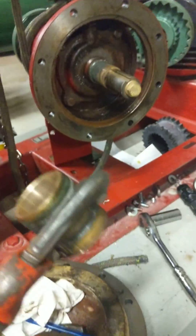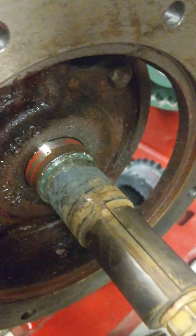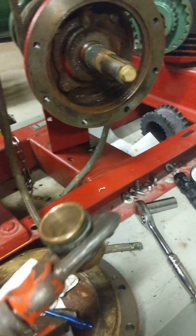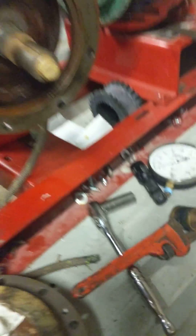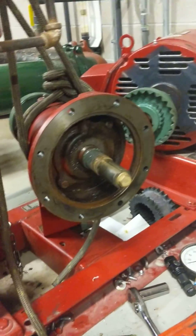And that is how you remove the sleeve from there. Not too much heat. Just gotta be patient. Heat up slowly, a little expand, pipe wrench on there, and you're off to the races.